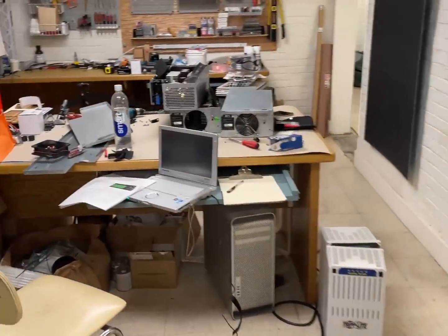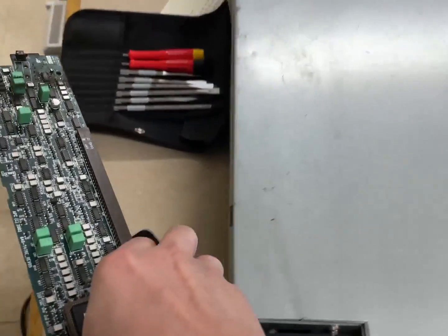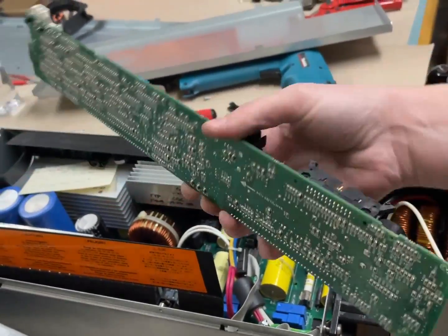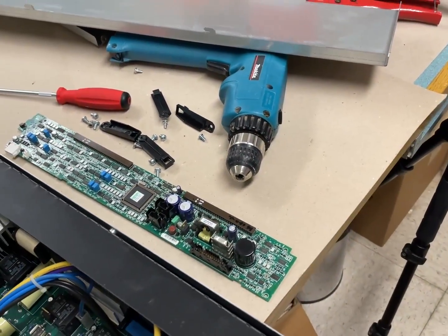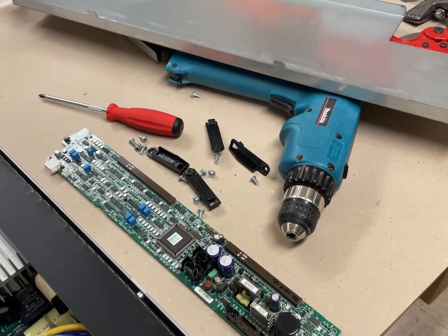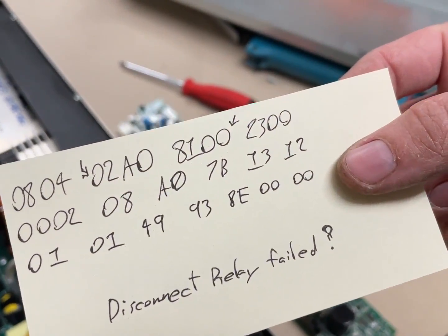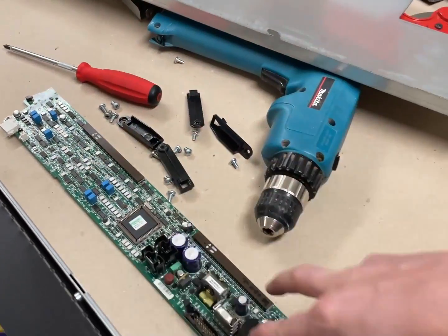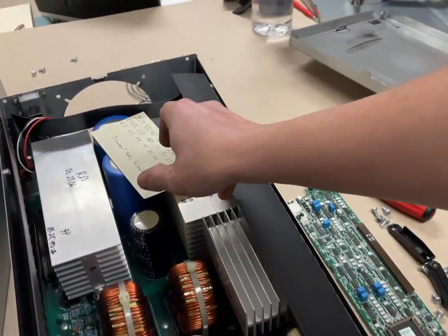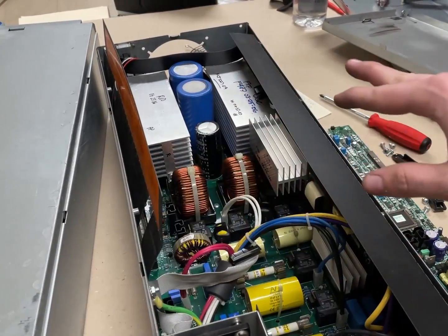So that means the 8000 and the 8100 fault has to do with this card. We have one card that has no communication — it's mute, it will not talk. We have another card that has the 8100 fault, and that one is fixed by replacing the board. When you move this card to another chassis, it brings all those problems with it. So we don't have to worry about replacing the big capacitors. Oh yeah — 8100 again.